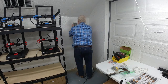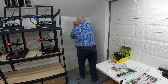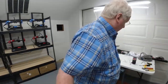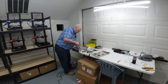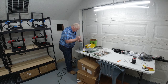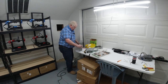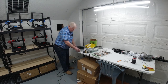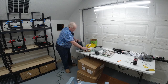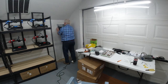Now we're installing the electrical breaker panel, which will supply power to all of our printers in this room. Once that hole is cut out to the proper size, we'll mount the box, knock out the knockouts on the end for the electrical wires going in and out of the panel, and then start putting in some receptacles. These receptacles will all be 20-amp receptacles, and each one will have its own individual breaker.